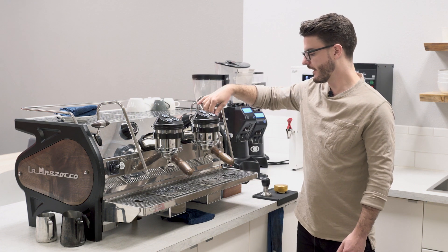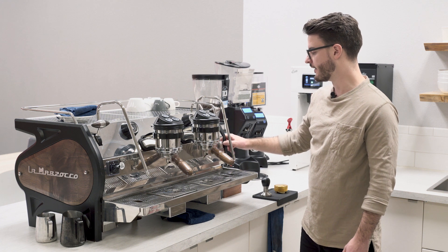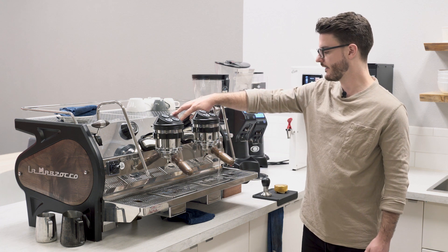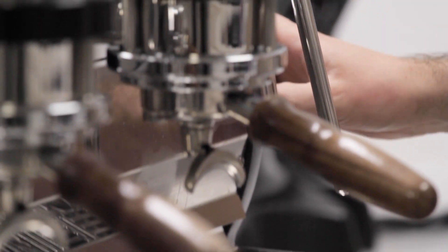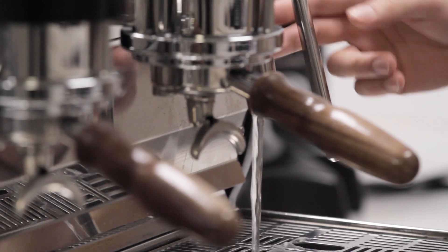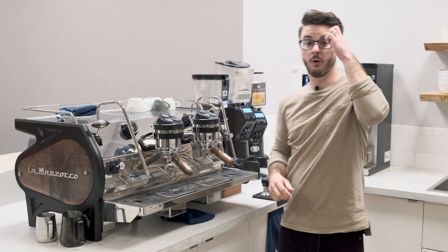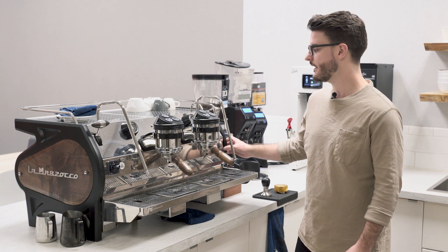The hot water also has a mix valve on it, which gives you pretty controlled output — not crackling or anything crazy. On the side here is the temperature control that adjusts the mix valve, which adjusts the mixture of cold water versus water from the boiler. If I turn this all the way up and run it, that's now straight from the boiler. And if I turn it all the way down, I get straight tap water — which I can just hold, it's cold. I'm going to put it back to the middle where we had it.